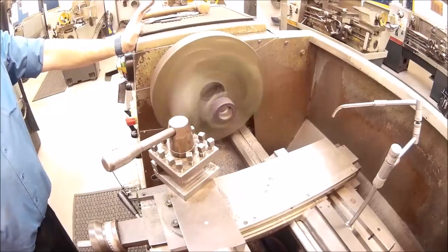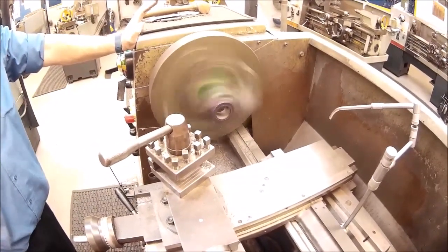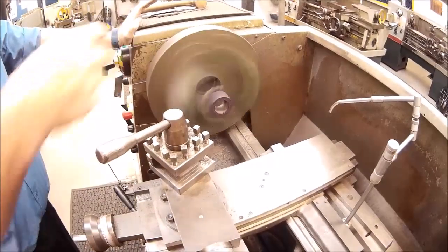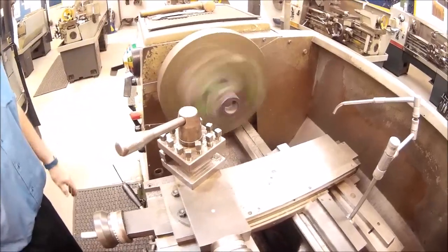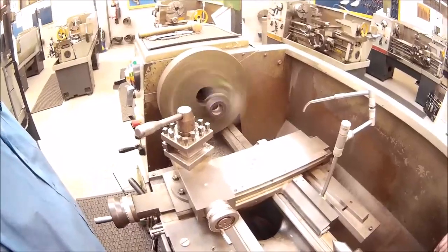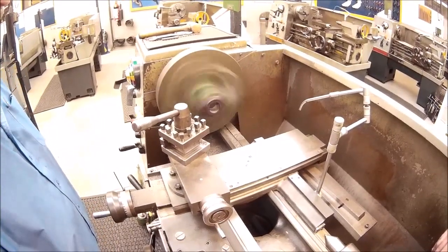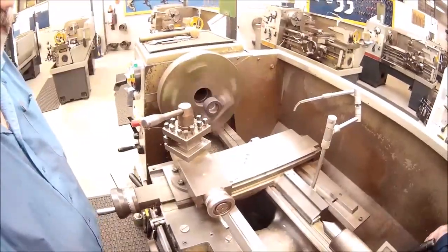If you get a little bit of vibration and you're a little concerned, switch it off and readjust your counterbalances. Given that we're using pretty much the same setup on all machines, if you put your counterbalances in the same places as it's been shown, then this setup will be pretty close to right. Okay, and then we're ready to go. Remember, stand in this position when you're actually doing your work. Bore your hole out first, face it off to size, and then take her off the faceplate. We're all done. Any questions?